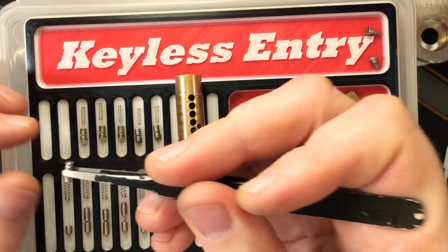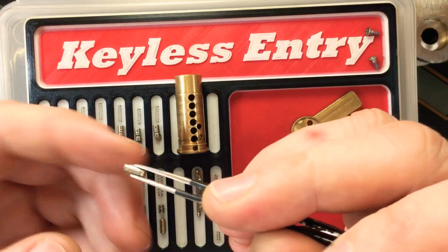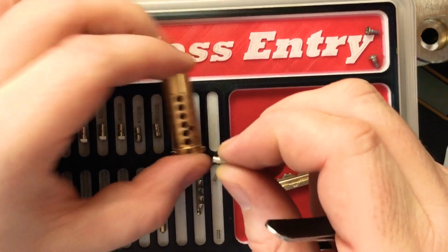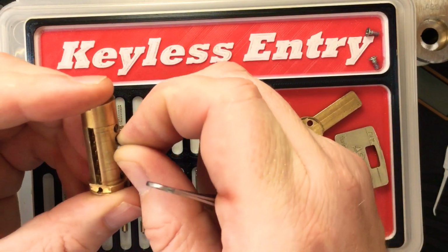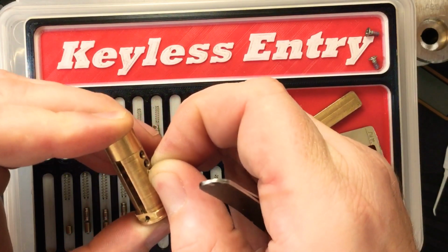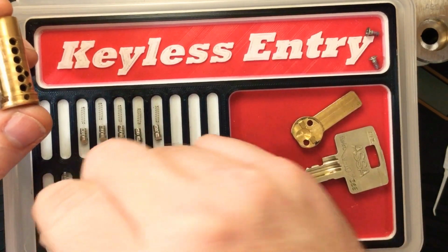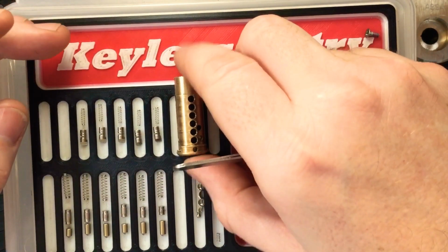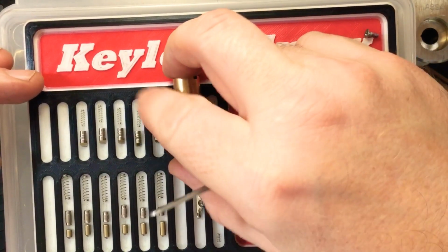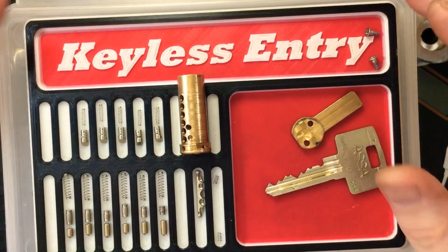And then for the pin tumbler part, you got these Assa barrel spools, which are very, very tricky with these very sharp lips on the end, and they really do catch on that milling. Really, really nasty actually. They're really grabby. Yeah, very, very tricky lock to pick. I have invested some time into this lock, so yeah, it's not every day that I can open it like that. Some days it takes me 5 minutes, some days it takes me half an hour.